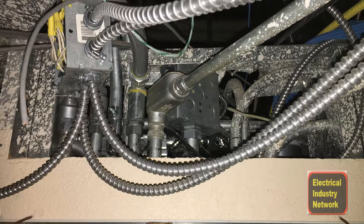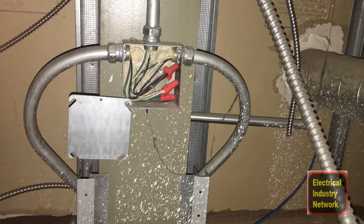Over the years people will do the quickest, easiest, cheapest, fastest, laziest methods to get down into a panel when they're adding stuff. So here we have a mixture of LBs, boxes, extension rings, and some seal-tight. Honestly, this is just poor workmanship and pure laziness. Somebody goes and looks at that and thinks, 'What the hell, somebody else did it, so why not me?' The problem is people are just in a hurry — get it done, get out, do it the cheapest way. But there are better ways of adding stuff into a panel. It's tight up in that corner, but it should be cleaned up and done the correct way.